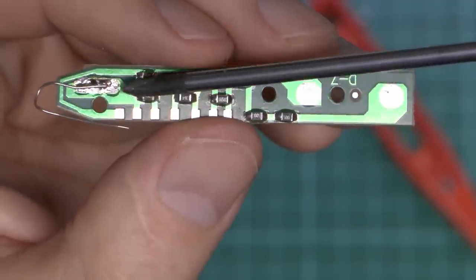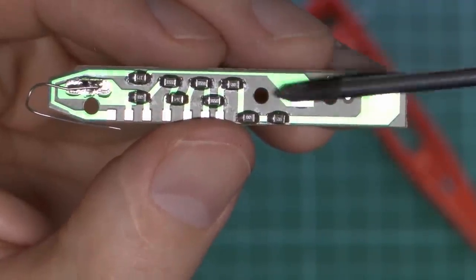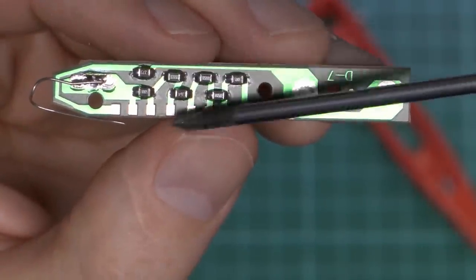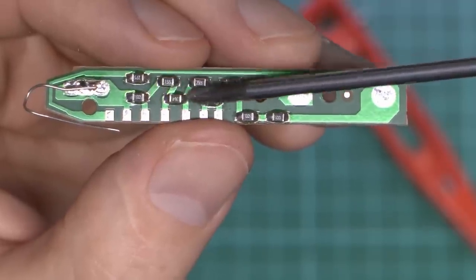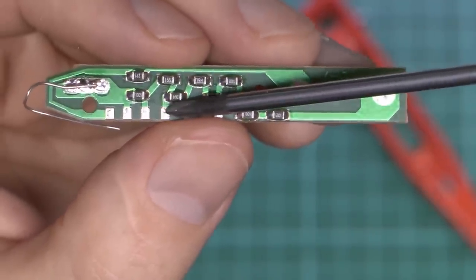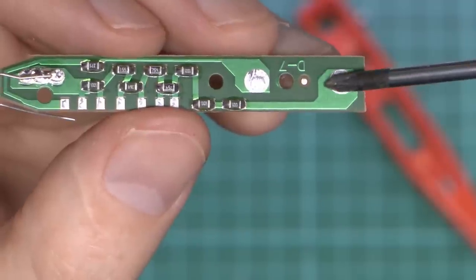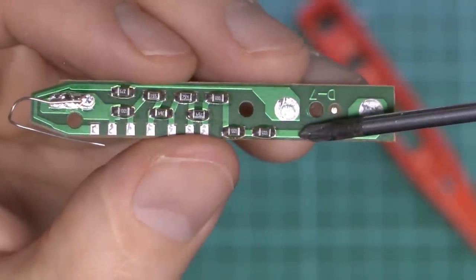So literally, it's just wires in at the bottom. And then this button essentially goes around to the pad there via the resistor. And then the others, it's just a voltage divider, essentially. So depending on the voltage applied, it will turn on one or more of the segments. And it's using basically your body as the capacitive ground at the end here.